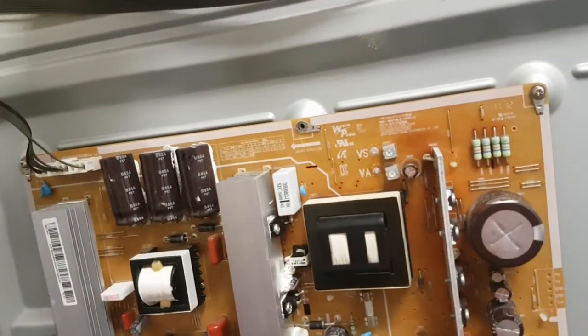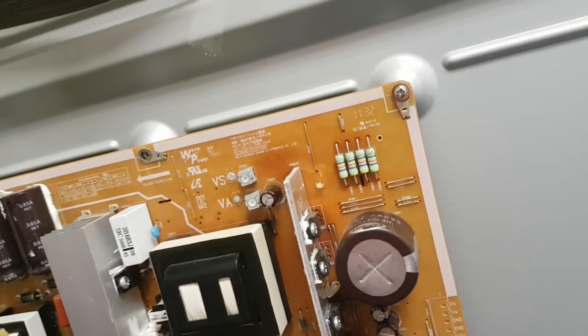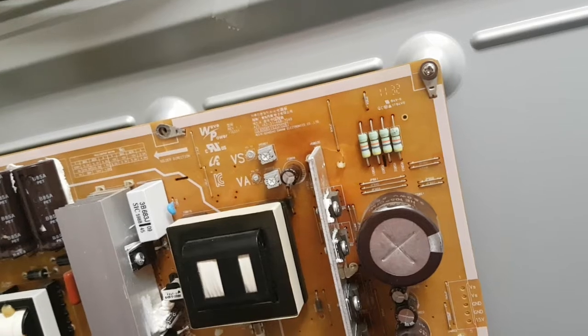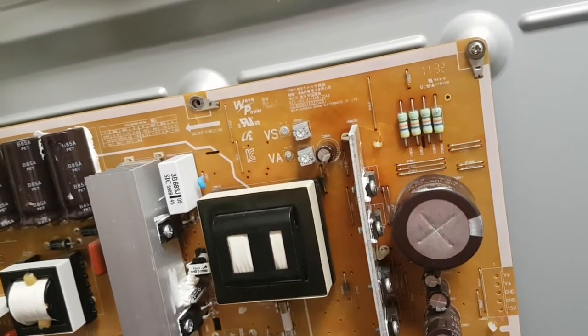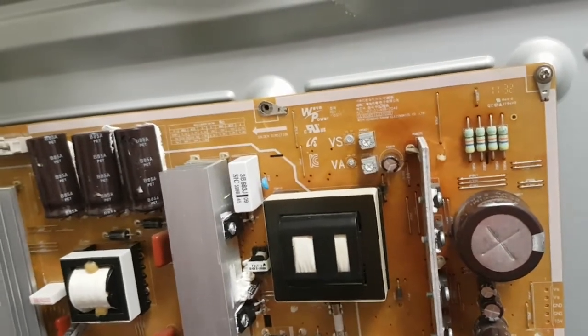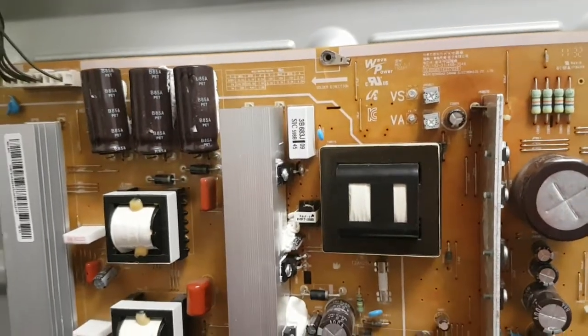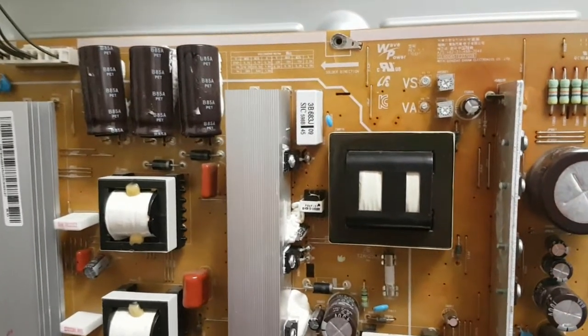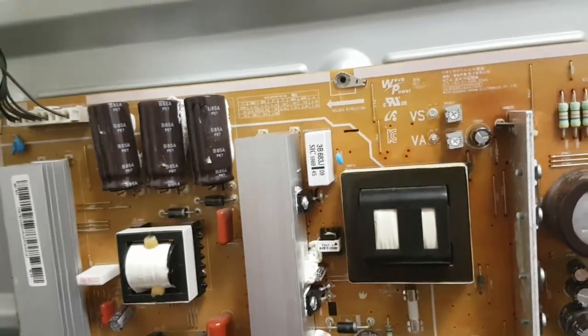It took me a whole week of digging, because I was preoccupied thinking that something was wrong on this side where the cracked tracks were and some components may have not been fixed right, and the problem turned out to be completely elsewhere. It was a pure electronic failure rather. It was the driver IC for the VS and VA voltages, and once that was replaced, everything is fine,